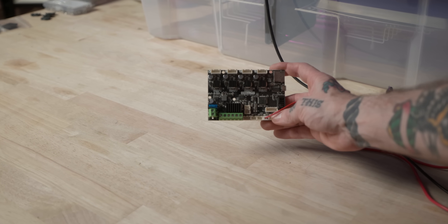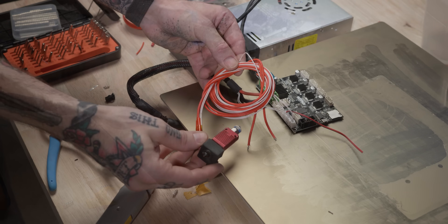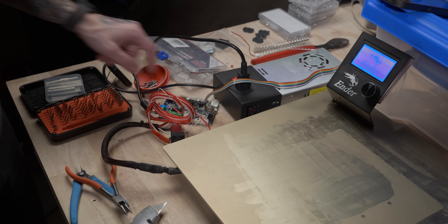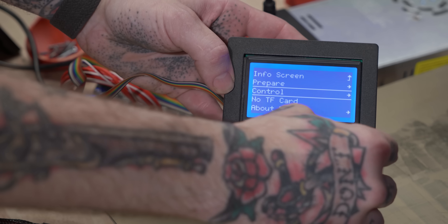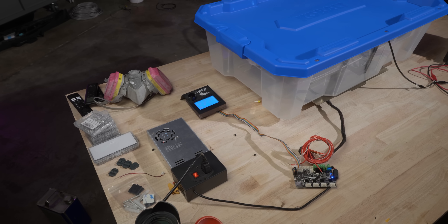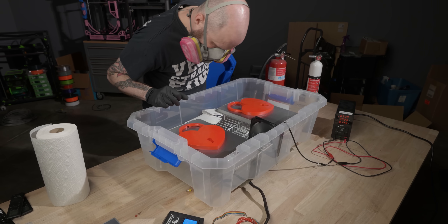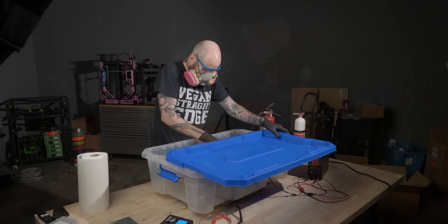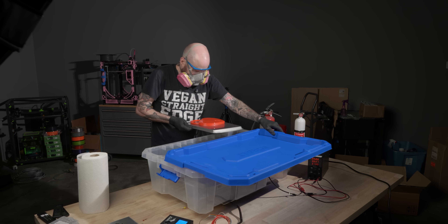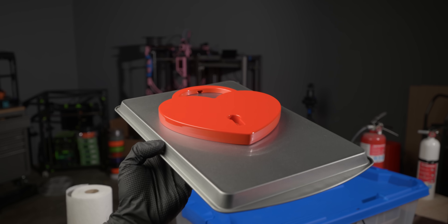In comes this old Ender 3 mainboard, the original bed heater off my Ender 5 Plus, and a little bit of hacky wiring to get it all together. I ended up having to throw a dummy hot end on here because it needs that input to make this thing think it's an Ender 3 with Marlin firmware on it. So I have thermal runaway protection and the ability to set the bed heater to function as a chamber heater to heat up the acetone and help the vapor smoothing process. Actively heating underneath this container really started to evaporate the acetone faster, creating more vapor flowing around inside the chamber. Definitely getting some nice shiny results — what I was looking for.